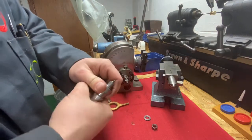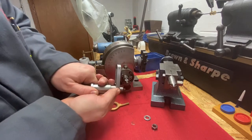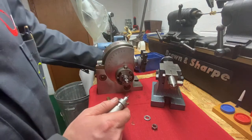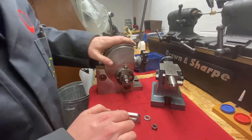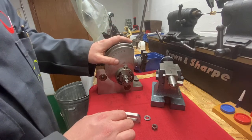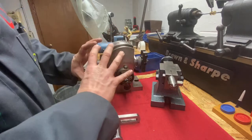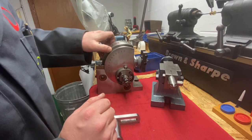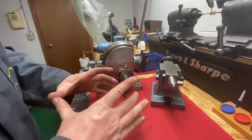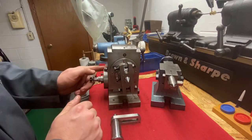This spins and rotates, and that's what gets you your different divisions. This one I believe they call a half universal. Half universal means that you are able to adjust the angle. The other one that we had — just a plain dividing head — you can't adjust the angle on it; it has to stay as it is, so you can either do it as a table or put it on its side. But this one, you can create any angle that you want along there up to 90 degrees.